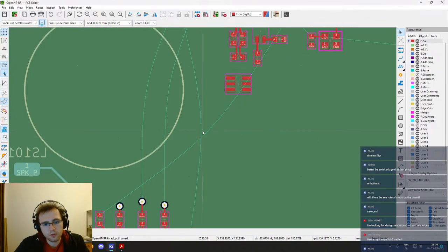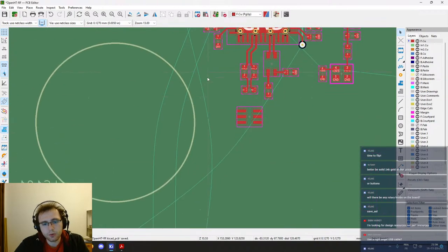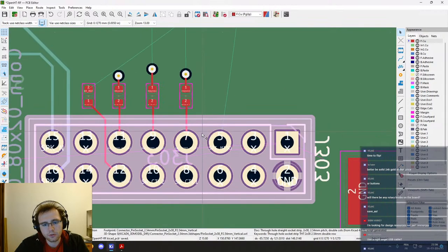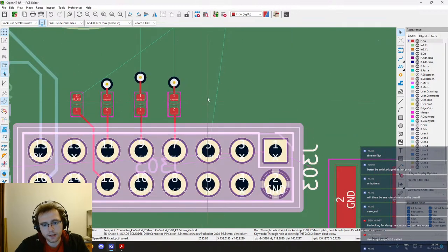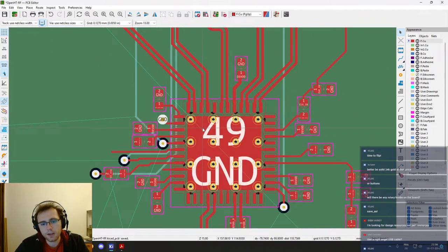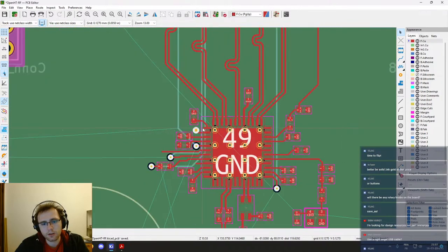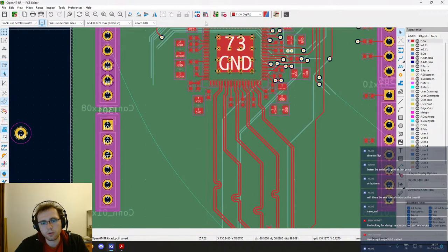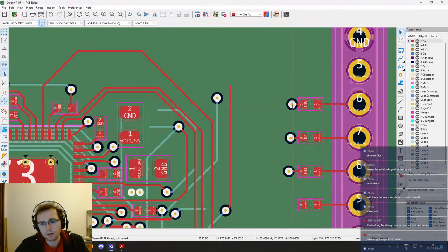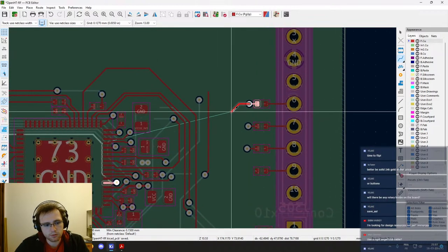Okay, time to reroute some signals. So there are some that we won't be able to rearrange, at least on the connectors. So those are the SPI pins. They need to be on specific board pins, but on the FPGA they can be anywhere we want. And also there is a strict pinout for the transceiver, of course. Okay, let's see this one. Where does it go?